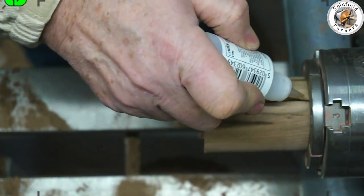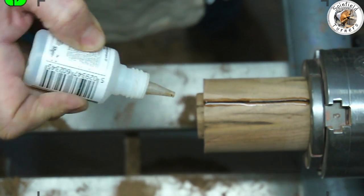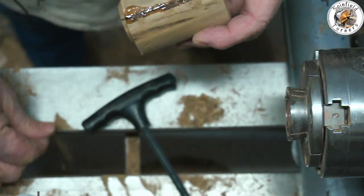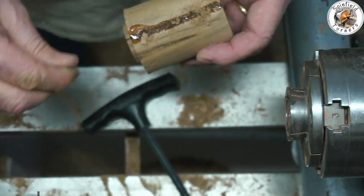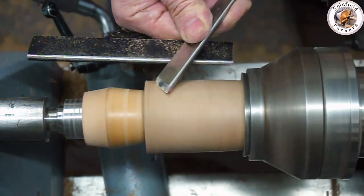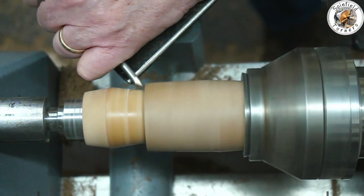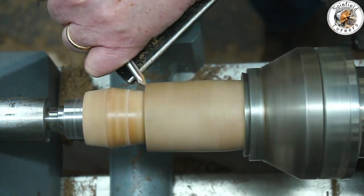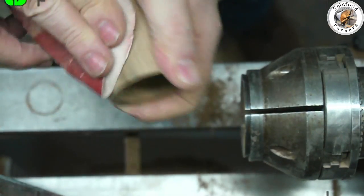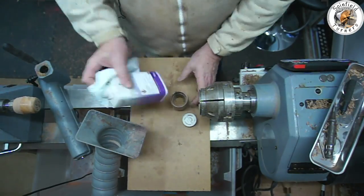I got a crack because I'd messed up with the jaw sizes. I now need to reverse it and drill the hole from the other end. Using the 35mm jaws which fit perfectly into the 44mm recess in expansion mode would have just blown the piece apart, so after gluing it up I've put it in a regular 50mm set of jaws to lightly grip it with a tailstock wooden live drive. I can cut into that if necessary to dress the face, then sand with the grain through the grits to address a couple of minor dents from the chuck, and finish with some mineral oil.